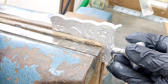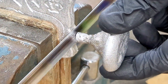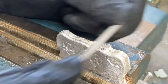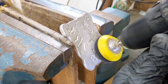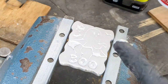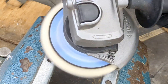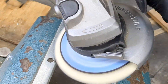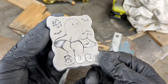Now that these are all cooled off and I'm able to touch them with my hands, it's time to cut off the sprue and the vents. After that's finished, I'm now going to file it down and make it take shape so I can reuse this as a pattern for the future. Then I'm going to sand this down and give it a smooth polish so it has an exceptional surface finish, which will allow me to have great replicas when I cast them — requiring a lot less finish work.